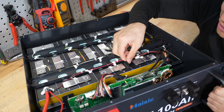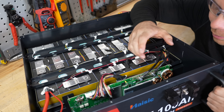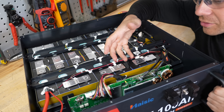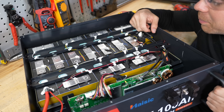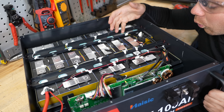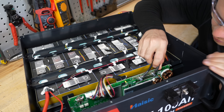There are temperature sensors, and this BMS has inductors, so it can probably throttle the charge current to 10 amps like the more expensive server rack batteries. But they have bad cells — these do not pull the full capacity. What a bummer. I've never seen this good of build quality at this price, but with horrible, horrible cells. The BMS is incredibly nice for the price point — I'm actually blown away right now.